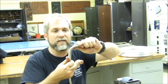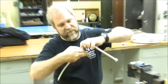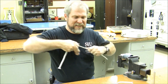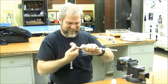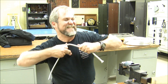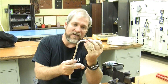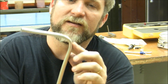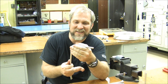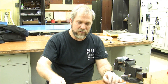Once I'm done with the bend, the spring keeps the tube from collapsing and I have to slide the spring off the top of the tube. This is sometimes easier said than done, but it is worth it when you have a tube that hasn't collapsed. There is our bend once we slid the spring off. The spring technique is good in that it is a whole lot cheaper. It is not so lovely in that it does tend to flatten out the bend of the tube a lot more.